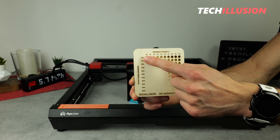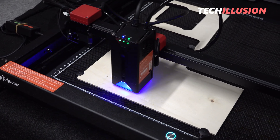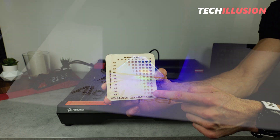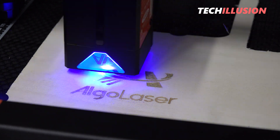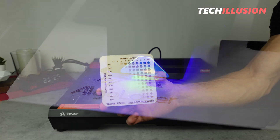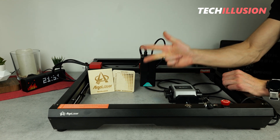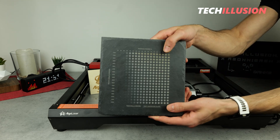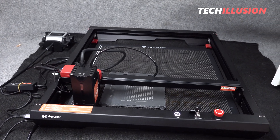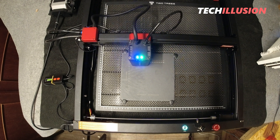If you use this laser, you can use these settings to achieve optimal results as well. I began with testing the engraving power, as shown here, with the speed in millimeters per minute on the Y axis and the power in percentage on the X axis. At 100% power and 1,000 millimeters per minute, the laser practically burns holes in the wood. We have a nicely descending curve, and even at 6,000 millimeters per minute we still get good results. I would personally recommend aiming for about 4,000 to 4,500 millimeters per minute at 100% power. With this laser, you can also work with thousands of other materials such as wood, metal, plastic, leather, leaves, and even slate. I've also thoroughly tested this on a large test board, with engraved points from 1,000 to 10,000 millimeters, and the drop in power is not as significant as I personally expected. Even at 10,000 millimeters per minute, we still achieve excellent results.